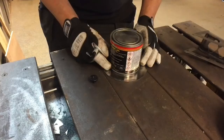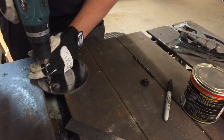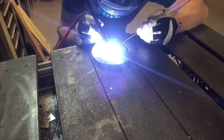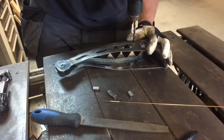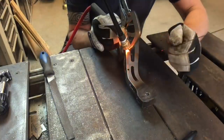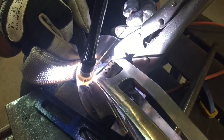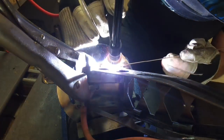Onto the swivel base — just taking a smaller diameter circle, marking out, drilling it, cutting out, simple job. As with the top arm, I just put the tubes into the sidebar section and plug welded them in for the cable ways.